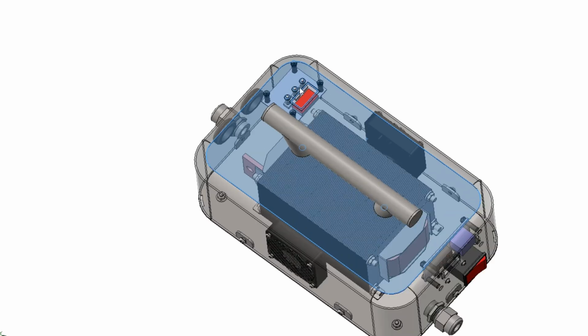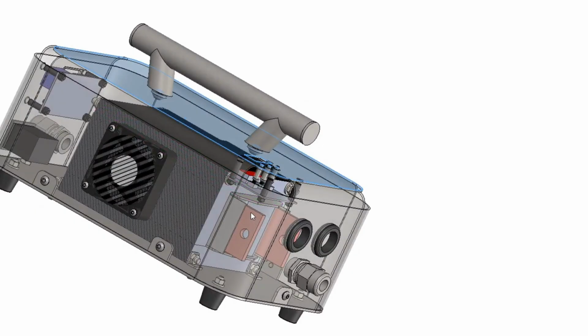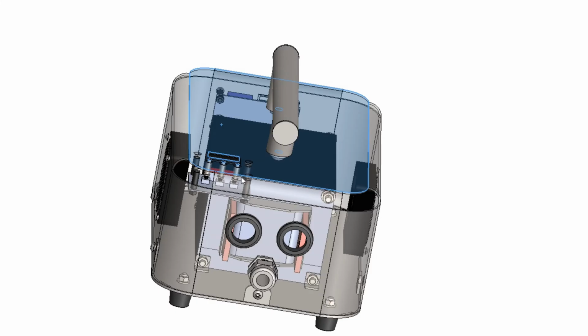This is controlled using a digital stat up here in the top. It is bolted to the enclosure itself. There's a probe, or a temperature probe, running to the stat, and it is embedded within the core. It's just sort of stuck in there, and you can set when you want the cooling fans to kick in, like say 20 degrees or 25 degrees. You also can set how long you want it to stay on from its initial starting point. Say 5 degrees below where it kicked in, so it cools down further.